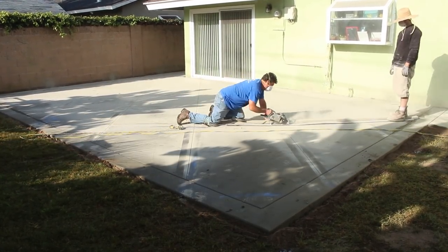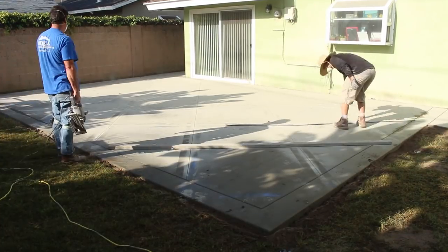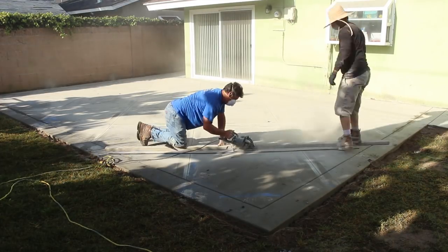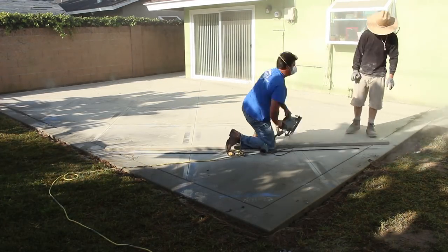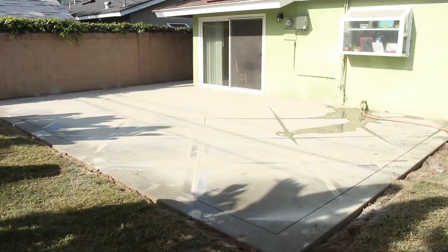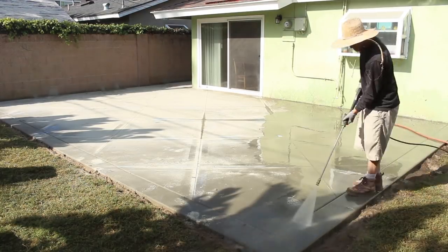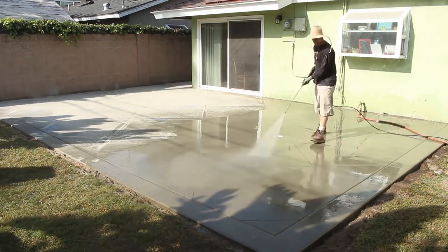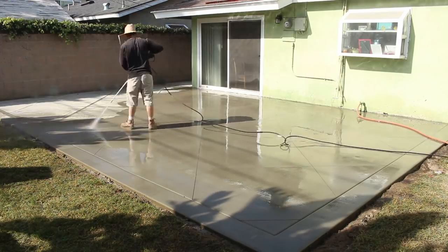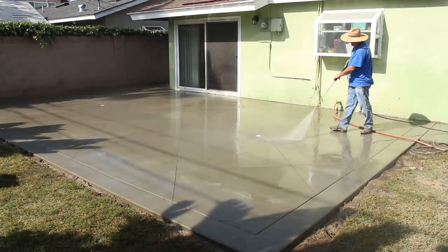I'm cutting about a half inch to three-quarters of an inch. When you have a four-foot-six-inch spacing, the chances of getting a crack in the concrete that's not in one of these lines is very remote — that's the beauty of doing cuts that are close together. It's kind of the same concept as throwing pavers down. Pavers are made of concrete and the reason they don't crack is because they're so small. If you do that with poured-in-place concrete and make smaller pieces, you're not going to get visible cracking.